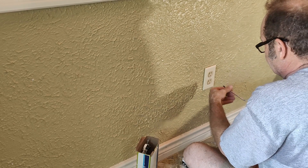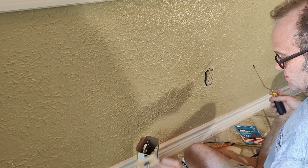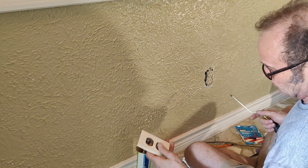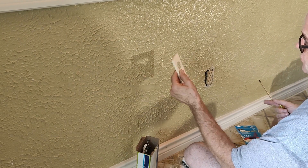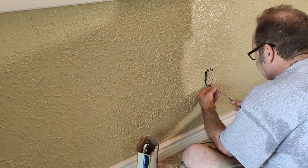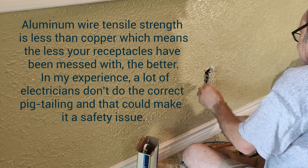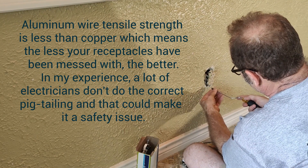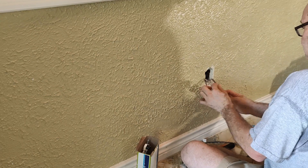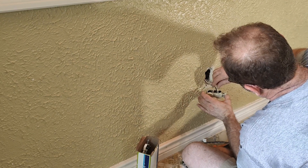I'm going to give you two options here, but I haven't actually opened these up, so I'm guessing by the rest of the outlets in the house. What we have here is a replacement cover that's obviously not new, but this looks like the original ivory outlet. You can usually tell just from the paint. Sometimes aluminum wiring is not very forgiving, so sometimes the less it's messed with the better. This might not have ever been pulled out. It looks original and these terminals are still tight.